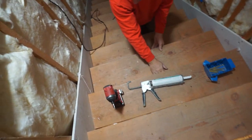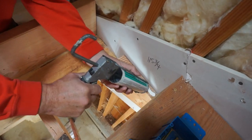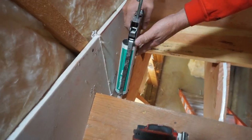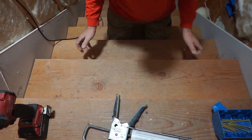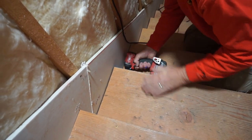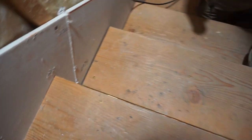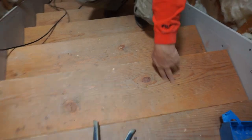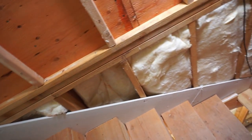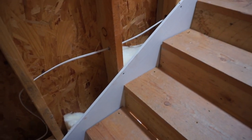We're gonna cheat a little bit here — you can see us ahead and there's insulation and electrical already done. The important part here is not just the glue that he's putting down, which helps your stairs not creak and be sturdier in general, but the secret sauce is the drywall on either side of those stairs. My dad did this to save the drywallers some time. Another way is to run the stairs full width and have the drywallers cut around each stair, but this is a much easier, cleaner, simpler way. That clean edge will be much easier to work with later.